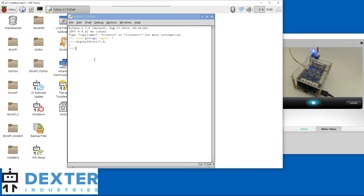You can guess that something similar is needed to turn the LED off. Let's enter DigitalWrite, parenthesis, 7, comma, 0, close parenthesis, and watch the LED react when I press the Enter key. Yay, the robots are not in control yet — we are! That's reassuring. Maybe you noticed that the Python shell is printing a 1 after each command. That's DigitalWrite telling us that all went well and the command got executed without mistakes.